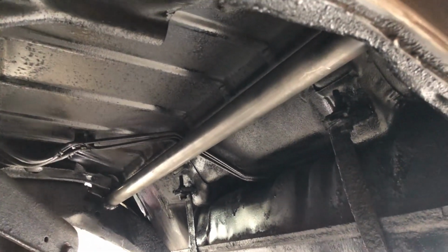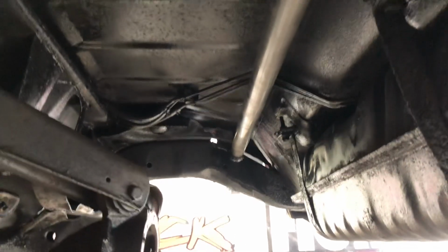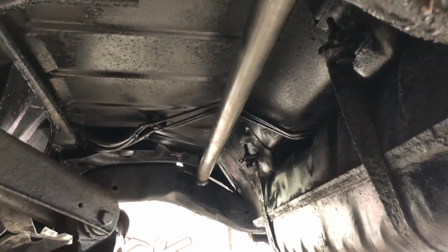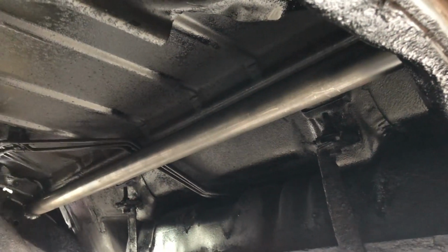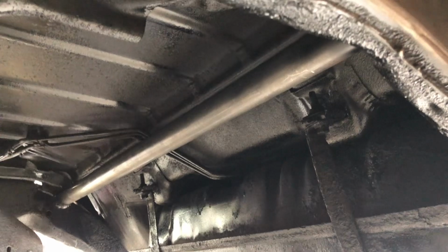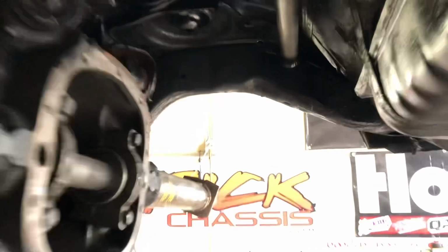Got the cross brace up in there. Cut the spring pocket area out. That bar, basically when you cut it out, is just shy of 42 inches. It's a 1 5/8 steel tube, like 130 thousandths. Sometimes when you go to a steel place, you can get what's called schedule 40, 1 5/8 round tube, which is basically within that thickness. Nice and thick, welded up in there.